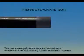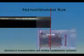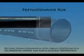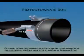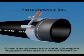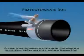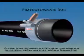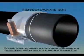At this point, it's important to mark the true insertion or the stab depth. Measure the length from pipe stops to fitting end and mark it on the pipe. Oval pipe can be an obstacle to forming a high-quality joint. Much of the pipe we encounter is not perfectly round, and re-rounding is therefore an essential step of the process. This is especially true with large diameter pipe. As shown here, clamps are placed close to the insertion depth mark in order to re-round the pipe end.